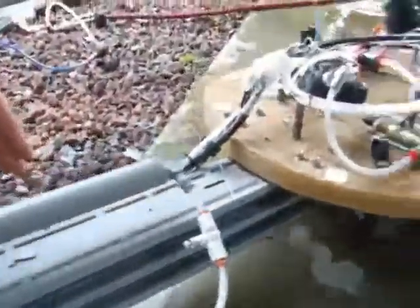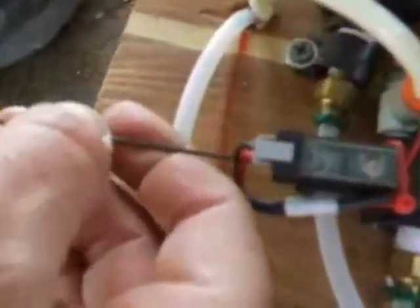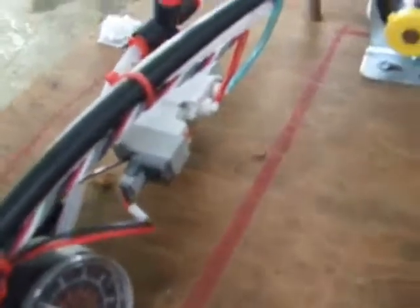When I push this it's going to operate the other cylinder and make it go the other way. Now we're going to move up here — this one is the next solenoid and it has a manual valve that does the head tilt. Then you have another one here with a manual override that does the jaw open and close.